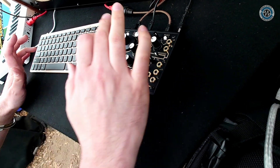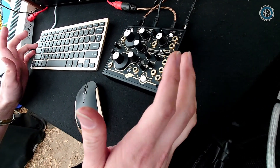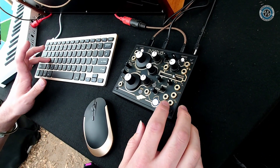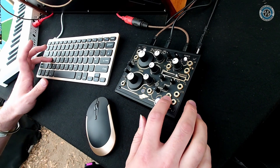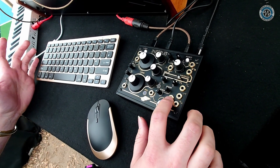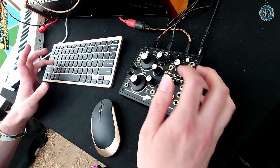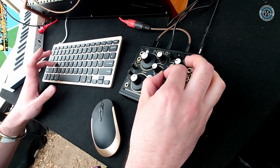So this is just receiving MIDI in — it's an analog signal path with two analog oscillators, an analog wave folder, an analog filter — a playable monosynth. MIDI notes are triggering the envelope, which generates an analog envelope normalled to the CV input over the filter and the wave folder. Very immediate in a top-level format.